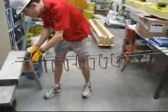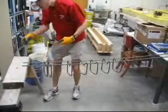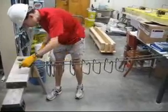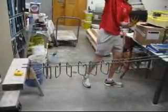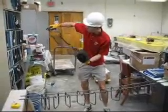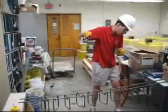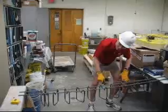Now we're going to get the spacing proper and tie the bars in place. The first stirrup should be about two and a half inches from the end of the bar. Now we're going to get the tie wire — it comes in a bundle like this, held on with two wires each running through the wing at the end. Safety glasses, or just glasses, always a good idea.